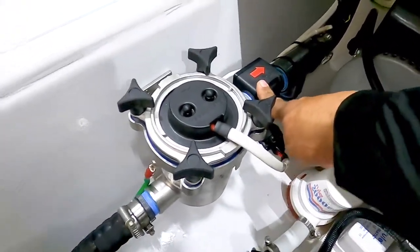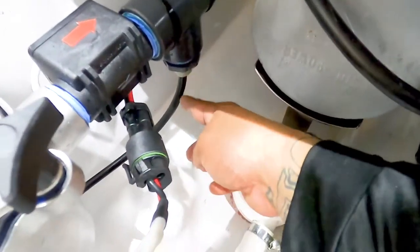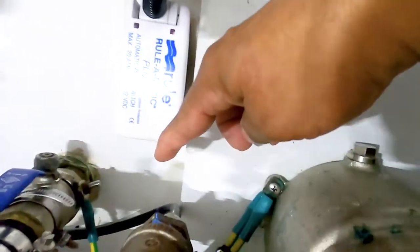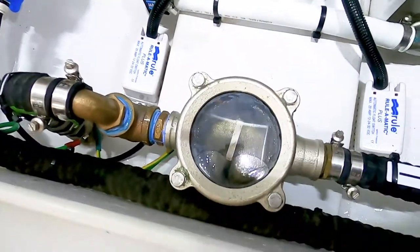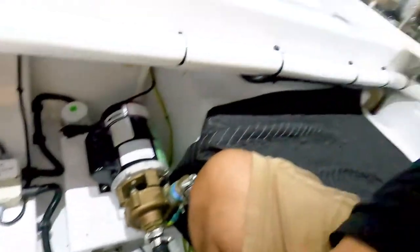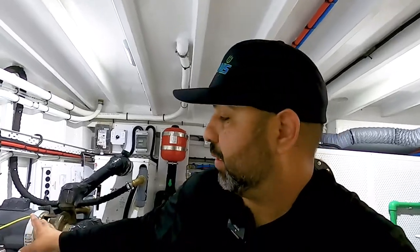The system consists of a cell and a flow meter. After the cell, we get some of the product made here and we back-feed it — you see this little black line right here — back-feed it to the bottom of this T fitting. That way we can help keep the sea strainer clean a lot longer, sometimes months.